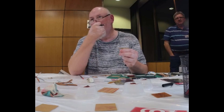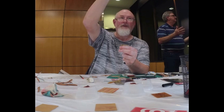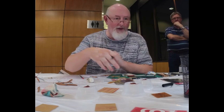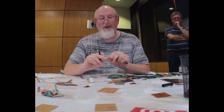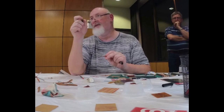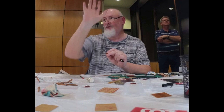So you've just got to think about how timber works and which way grain goes, because that is everything when you're applying timber. The albatross down there on the bench — that's all hand-painted timber, not decals. The other thing you can do is smudge it like on my botched one, then lay another coat over it. After that coat dries it will give you a depth perception but a deeper colour timber as well. On the albatross I did some yellows and a patch on one panel so that when I applied the oil over it, it came up with a distinctive two-tone, and then I put another layer over that as well — just to give it some depth.